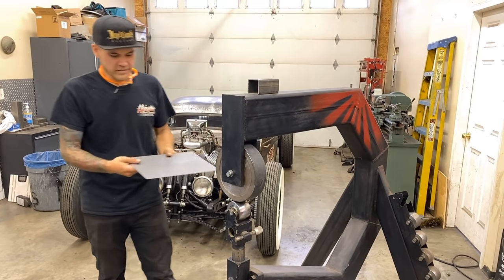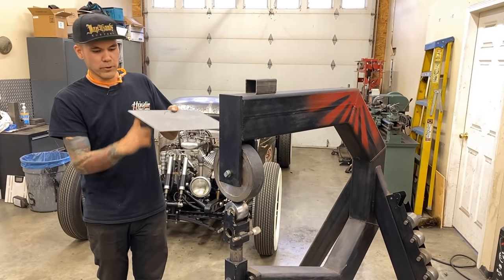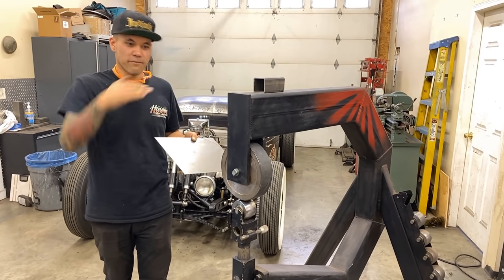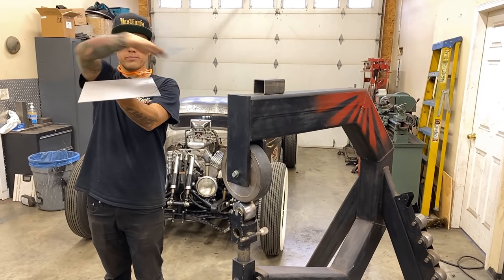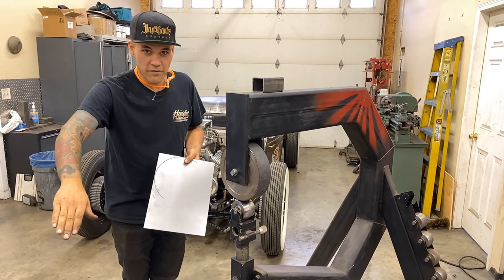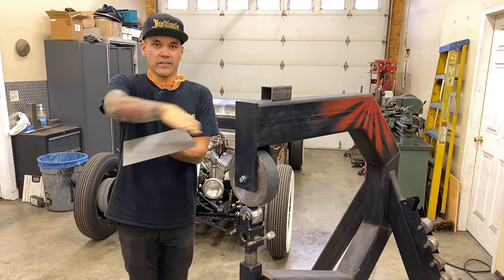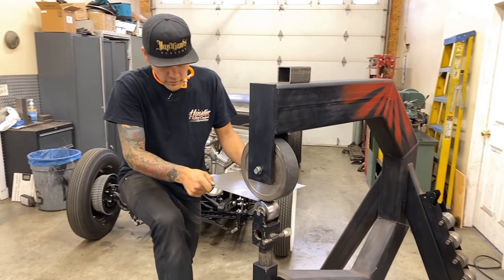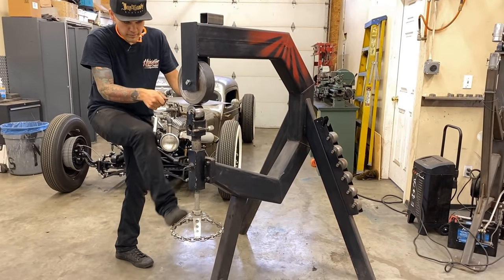So, like I said before, because this is soft, the lower wheel being hard is going to push into the sheet metal and press it into the soft, and it's going to take the form of that lower wheel. So if I wanted to just get a two-dimensional roll in this panel, this is what I'm using. For this instance, you do want to run right off the edge. You don't want to leave a frame because we want the roll to be the same here as it is at the edge in this case. So just tighten her up a little bit. There we go.